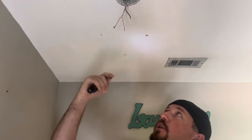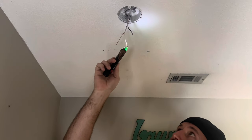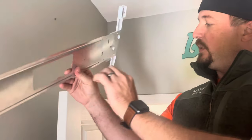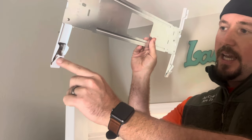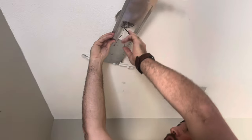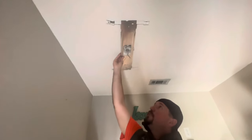We've already hit the circuit breaker and uninstalled the light that used to be here. This is a non-contact voltmeter — I'll link this in the description — it's a good way to double check and make sure you have no power here. Always safety first. Then you're going to take the mount, and the mount needs to go with the flat side up to the ceiling. If you look, this side has these curved ends — that's sort of a hanger — so you want that towards the smaller wall so it'll open up while we install it. Just make sure you put this in the right direction.